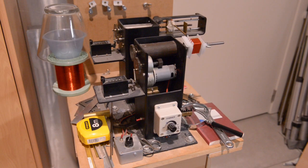Hi guys, just a short thing. I discovered I need a choke in the power supply. The screen grids of the EL34s have to be on there, and also the preamplifiers will be connected to that choke - so that's about 70 milliamps. I had a good look at the schematics I found on the internet and, to be honest with you, I don't believe it is any good. So I will investigate further. I have some books from Philips on amplifiers in the good amplifier section with the EL34. I'll have a look into that - also the preamplifier with mixer section.